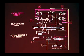There are 3 basic circuit divisions within the power shift valve. The circuitry indicated in red is the supply circuit and has the purpose of supplying pressurized oil to the clutches when the pilots are actuated. The circuitry indicated in orange is the pilot actuator circuit and has the purpose of directing pressurized oil from the supply circuit through the selector spool and to the selected pilot valves. The circuitry indicated in yellow is the reverse lockout and clutch lubrication circuit. Remembering the purpose of each of these circuits will permit a more thorough understanding of the control valve flows in each speed selection.